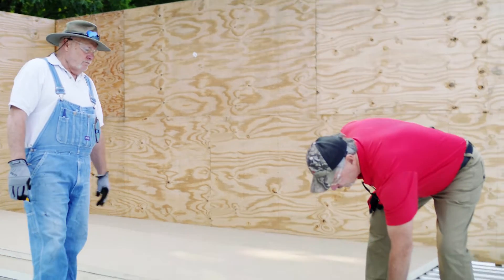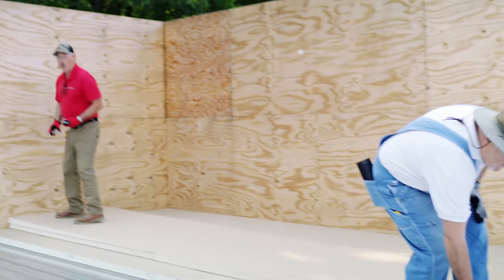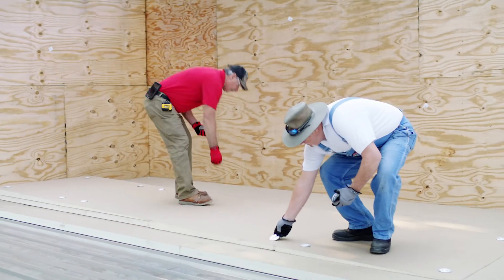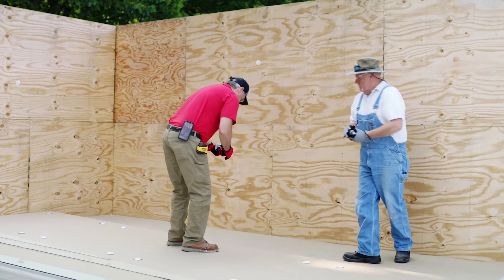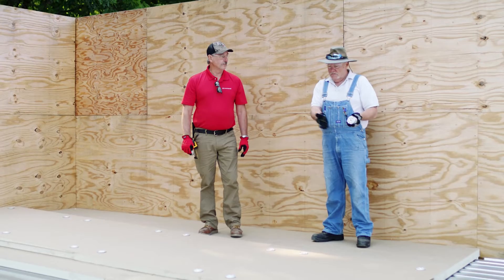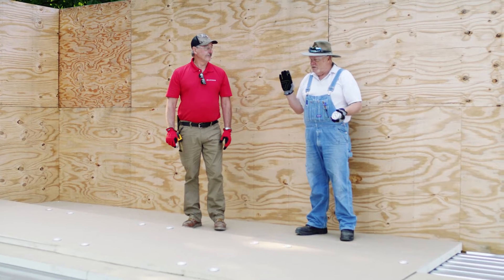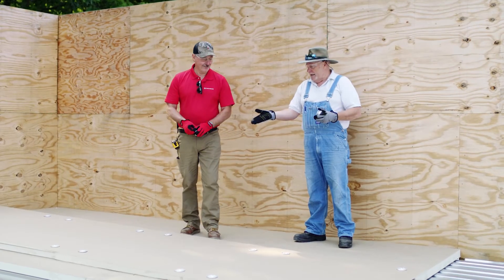Now, talking about fasteners - we have four by four boards, so how many fasteners do we need in each one of these boards? Four per board, in 6 inches from the edge, always. So somebody could do the math: depending on the size of your job, you're using a lot more fasteners than you really need to. There's nothing wrong with this, but you have eight fasteners for 32 square feet. If you use a 2.0 or bigger four by eight, you need five. That's three more per board with the traditional method - extrapolate that out over a big job.